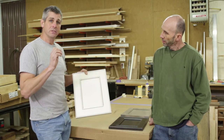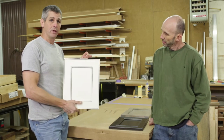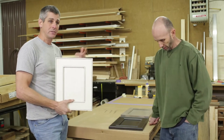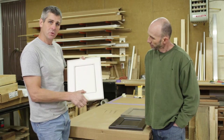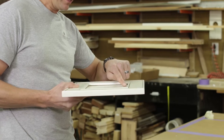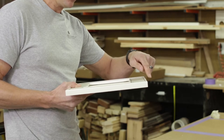People are trying to get away from a lot of curves and concave-convex looks and profiling. They just want simple beads, simple architecture, very clean lines — deviating from Shaker though. I think people are looking for a little more busyness than Shaker but not so busy as traditional raised panel stuff. This door uses a slightly wider framing — I think it's two and three quarters wide — with two little beads on an angle. You've got a kind of a hump here and then a flat space for hardware, and then a hump that matches on the outside.